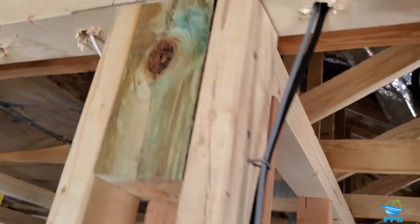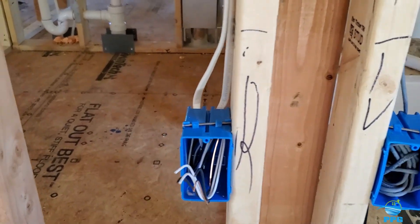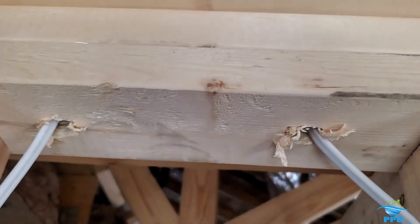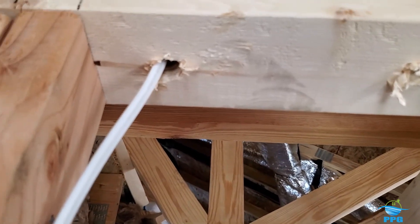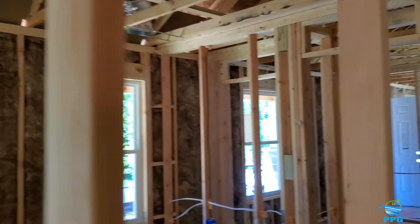So what you want is all the penetrations sealed. If a fire got started right at that switch box, the air in between those two pieces of drywall would eventually extinguish out, because you need air to keep a fire burning. With sealed penetrations, it can't access any more air other than what's in between those two pieces of drywall. But if we have open penetrations and a fire got started at a receptacle box, it would have access to all the air up in the attic and keep that fire burning. That's critical — very, very important.